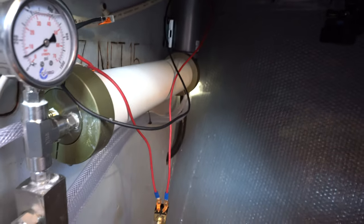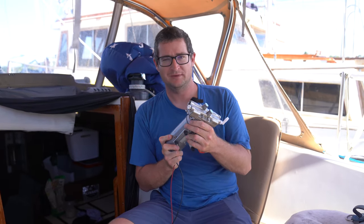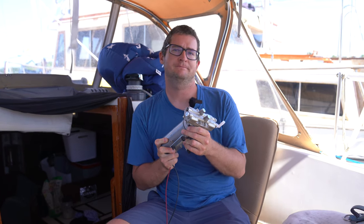I want to give a shout-out to Cruiser's Forum and specifically the user Pizzazz who found this pump and shared it with everyone. In full transparency, this is actually the second time I'm assembling the water maker. The first time, the high pressure was literally forcing all the sealant out of the fittings. I'm not sure if the sealant was old, used incorrectly, or just doesn't like seawater, but it squirted out of the threads and started shooting water everywhere. Today we're reassembling with Teflon tape rather than liquid pipe sealant, and hopefully that will work out.